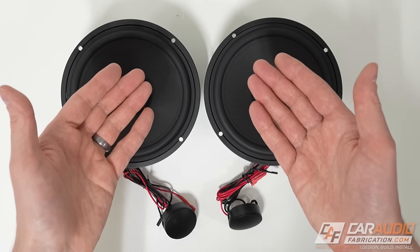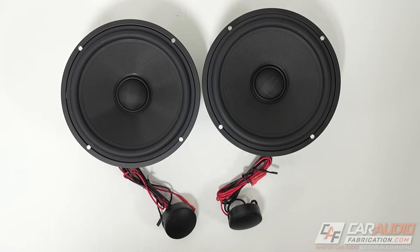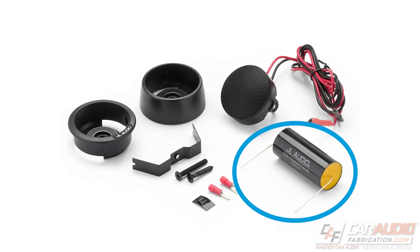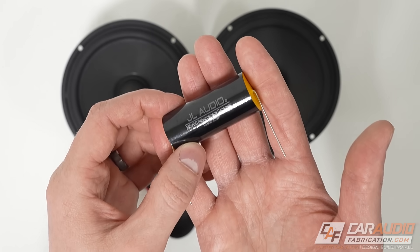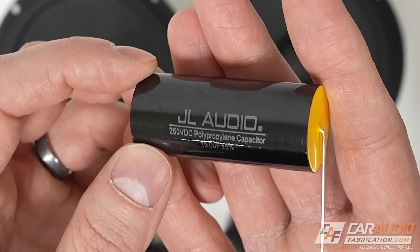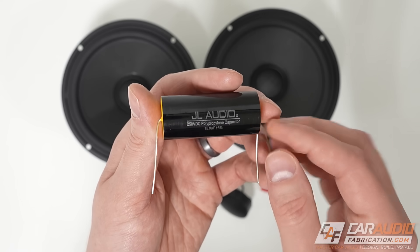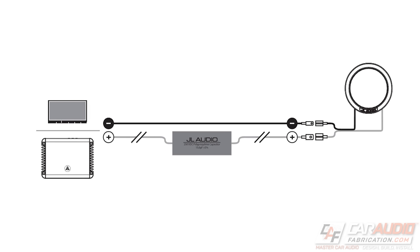If you're planning on running these speakers active, it's worth considering the separate purchase options — at the time of making this video, you'll save yourself about $100 by not getting the passive crossovers. It's also nice that we have access to purchase these one-off if need be. One thing to point out on the component tweeter: if you buy the tweeter individually, it includes one 15-microfarad tweeter protection capacitor — the same one included with the C7 tweeter — to guard against transient electrical pops. This is not meant to be a high-pass filter; you still need to set that up on your amplifier or DSP. This is purely tweeter protection, and wiring details are in the manual.